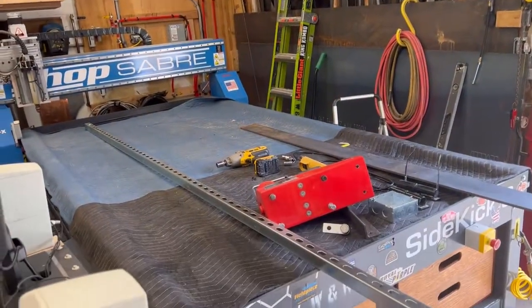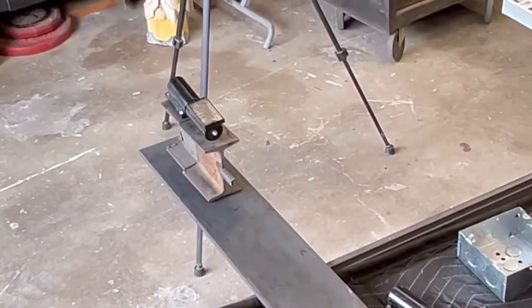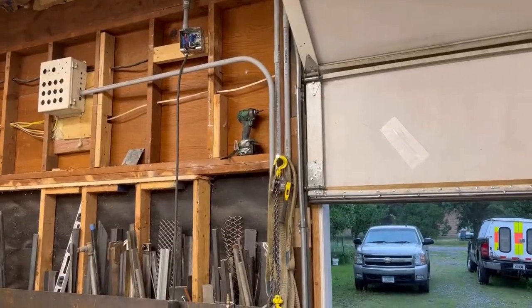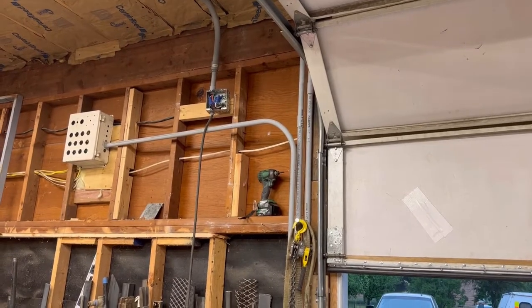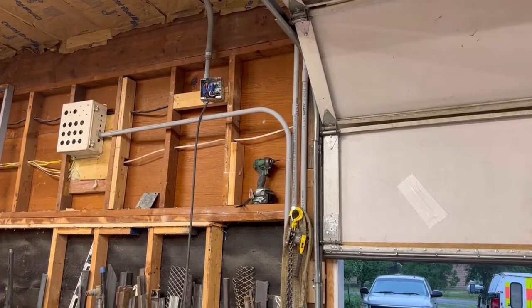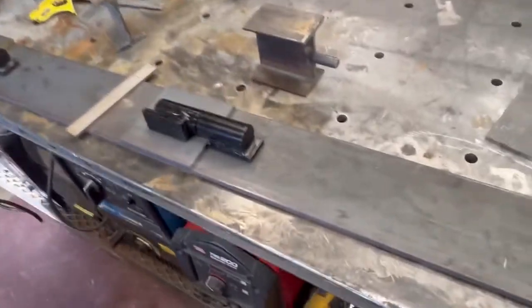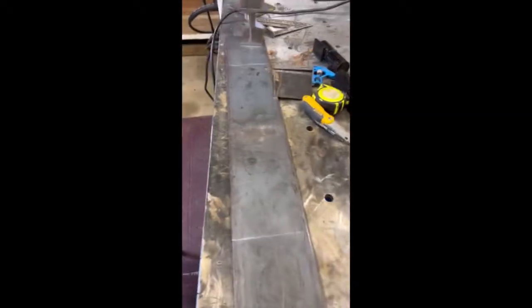We're going to have four-by-ten material and four-by-eight material that we'll need to get onto the table to cut our products. I'm going to build a standoff for the hinge coming off the wall so that nothing gets pinched or bound up. I'm going to beef this up — put in three more cripples and fasten everything together real good so I've got a solid base. I'll put three-eighths flat bar on the plywood facing, six inches wide, with hinges spanning 24 inches between top and bottom.